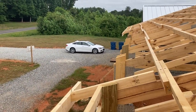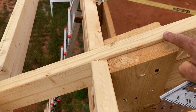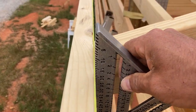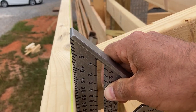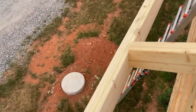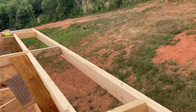We'll go down and see if we got one that's a little further off — these all look pretty good. I'm going to move this one just a skosh. We've just loosened these, slid the truss tail out just a little bit, and we're now just off the string slightly. That's how you can fine-tune this stuff — that was off a sixteenth of an inch. Luckily these are pretty nice, this should go pretty quick. They're pretty straight and they're fairly short runs, so they shouldn't be off a whole lot.